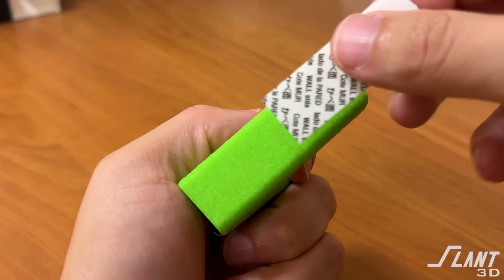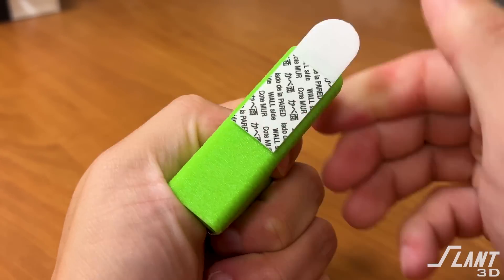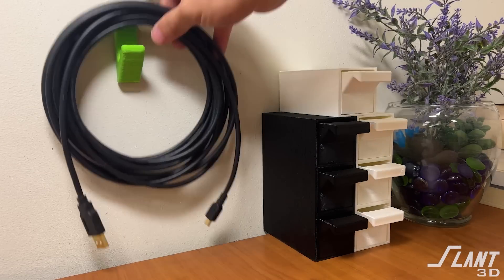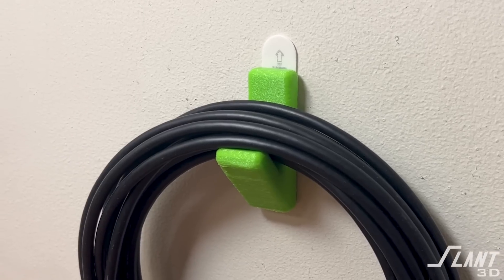If you really optimized this part for more functionality and mass-producibility, you could shave off the back arm since you don't really need that extra material — it's there to allow the command strip to press onto the back. Printing in an orientation that creates a weak hanger is not an option, so this way is best to ensure it's strong enough to hang a set of suits on top of it and still be a reliable part.